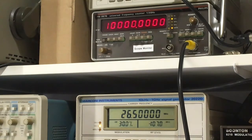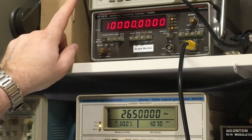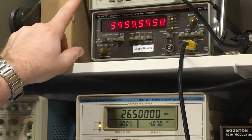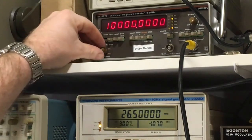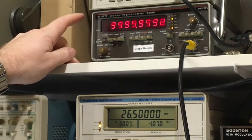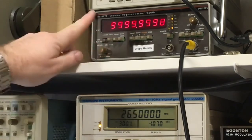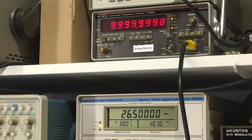I'll just let that settle for a while and see how that goes. As long as it stays bang on, that's right. This is really good calibration - excellent. That's more stable than the HP - the HP is actually less accurate and more affected by temperature. As soon as I take the case off that HP, the internal calibration goes off. The Philips one is much more stable - you take the case off and adjust it and it doesn't really throw it out, whereas with the HP it does. I actually have trouble getting the HP more accurate - it's really temperature sensitive even though it's got an OCXO on it. That's why I want to use the Philips one to get this sorted.